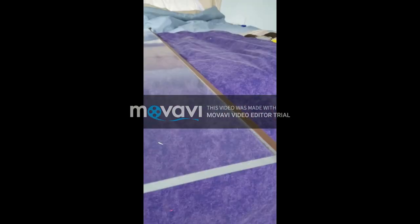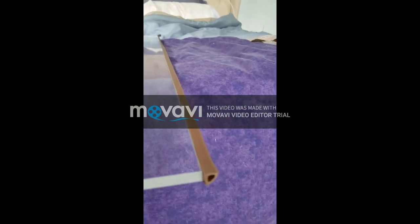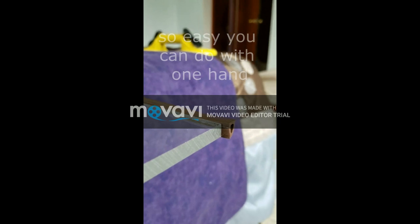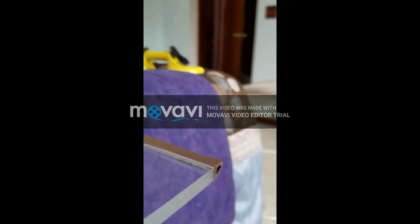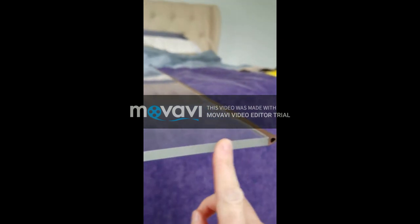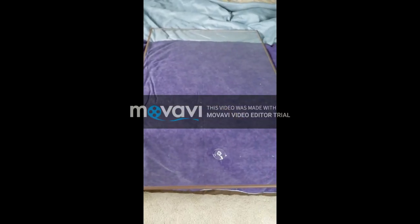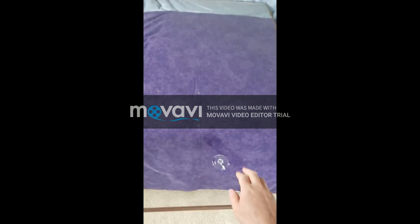When putting this around, do the long sides first and then cap off the top second. This will help keep the weather stripping from peeling off when you put it in the window. Cut with a pair of scissors on each side, then put a second strip going across the top. Don't try to put one piece of weather stripping all the way around the window as it will leave all your corners open and let in drafts.